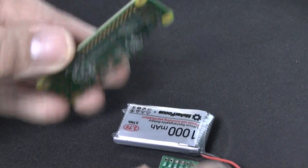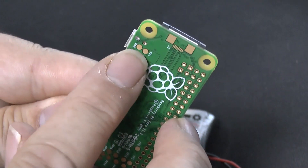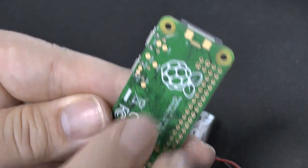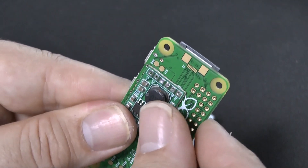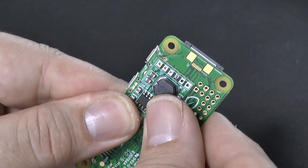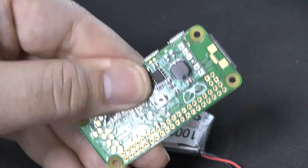If I look at the back of a Raspberry Pi Zero, you'll notice that on the power connector — behind it, underneath the micro USB — there are two little pads. On the left-hand it's negative, on the right-hand it's positive. Those two pads just happen to match exactly the two output pads of this little board, which means if I place the board directly over the two pads, I can then solder this little board directly to the back of the Raspberry Pi Zero, which makes a really neat, low-profile setup.